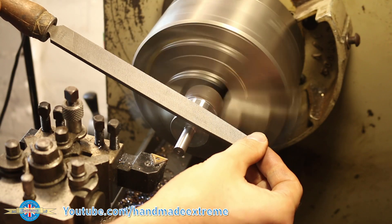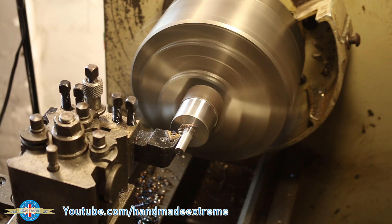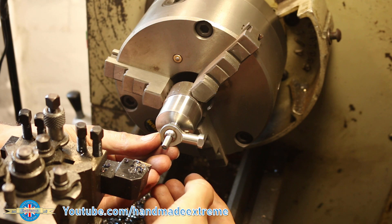Just knocked the sharp corners off with a file. I then machined down a short section for a rose joint. The rose joint allows the base to stay still in the centre of the circle and the arm that goes out to the plasma cutter to revolve freely around it. Here I am doing a quick test fit of the rose joint.